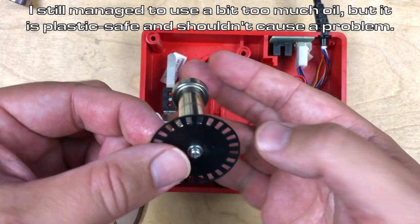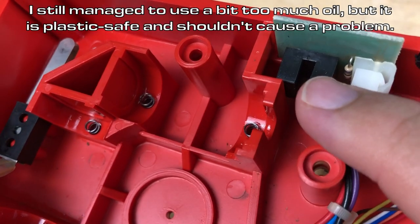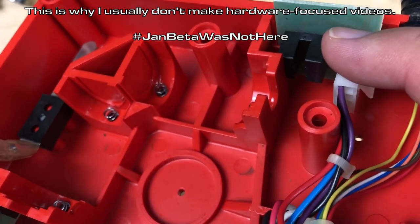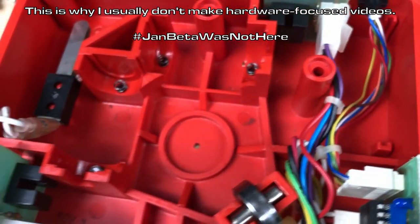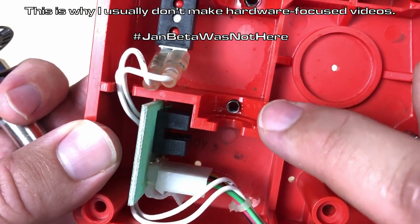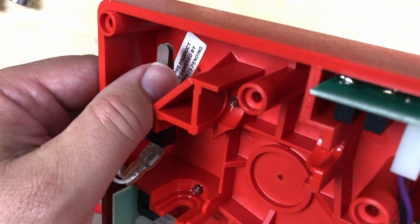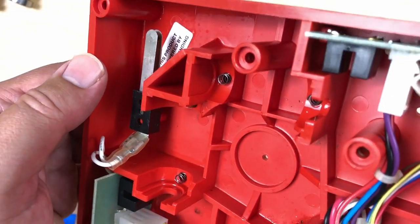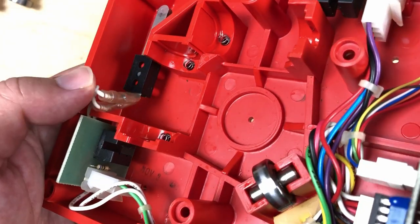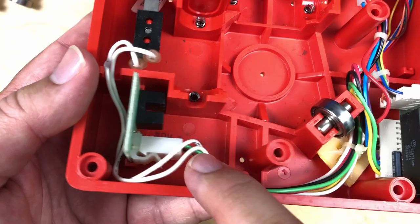So yeah, there's 2 of these, and those wheels go in this optical sensor that can count the rotations. And it does have 2 little springs sitting under each roller. There's the fire button switch. Wico joysticks generally use pretty high quality components. See, everything's very cleanly done here.